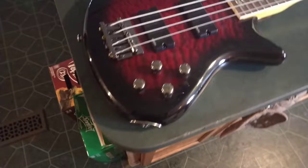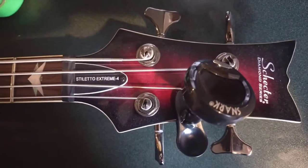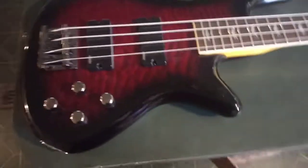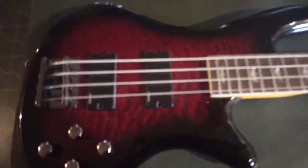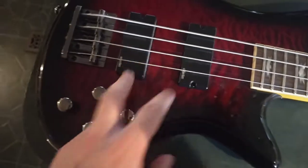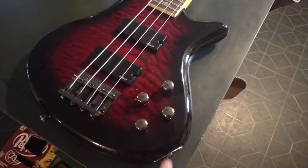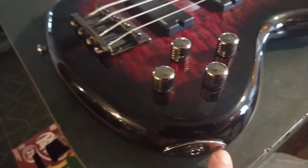I decided to document this surgery that I'm going to do on a Stiletto Xtreme 4 Schecter Diamond Series bass. First thing I'm going to do is open this up and check the connections. Basically what this bass is doing is not registering any communication from the pickups to the amp through the input. We checked the cords — the cords were fine. Basically it's an issue in the bass, so I'm going to open this cavity up first and check the connections.